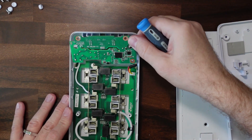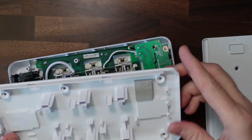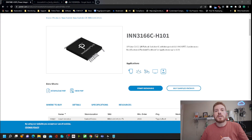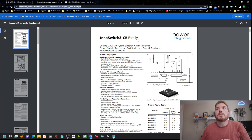Let's see if we can identify what these chips are, or if I need to bust out my microscope to pull a good image. One thing I noticed is that there's a thermal pad on the back of the unit, covering some chips. This chip right here is the INN3166CTAC-H101 — a flyback switcher integrated circuit. It shows some applications, and I'll have links to the datasheet in the description below. That's really the only chip I could find online. I'll post full-resolution photos on Instagram — I'll drop a link in the description.